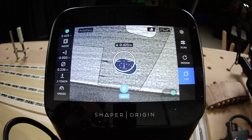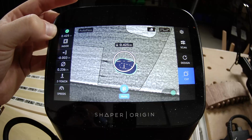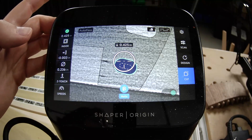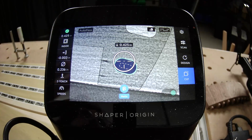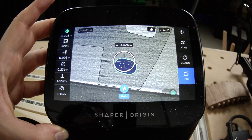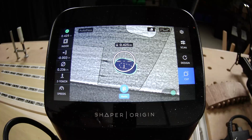So I realized I needed to update my depth, so I'm going to go ahead and recut these helixes. I'm going to forget about autopass, plunge straight to my final depth, and rip through these mortises, because they're completely hidden. They're blind mortises. You're never going to see them, even if they are a little wobbly. And you're using the 6mm. And I'm using the 6mm, so it's going to cut really cleanly, and it's going to fit inside these mortises perfectly. Sweet. Okay, off to the races.